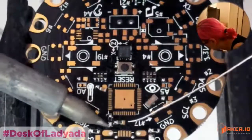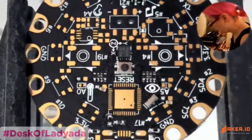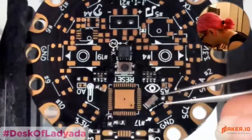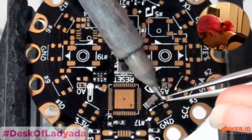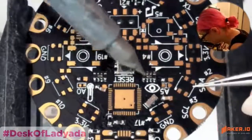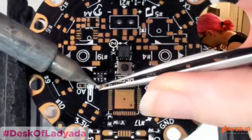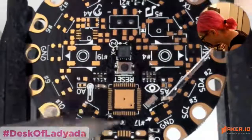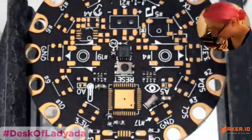And one of the things you can get in production, which I don't use that much, but other people do, is automatic optical inspection. When you do optical inspection during manufacture, the manufacturer will basically use OCR, but for components. It can't really tell what's going on, but it can say there's a rectangle here, and the text 105 is over here, and there's a silver thing over here. So it can do some basic analysis of what is in place. That might be something to think about while you're prototyping: if you're going to use optical inspection, you have to make sure that every component is visible. And what components are you going to pick that can be optically inspected?